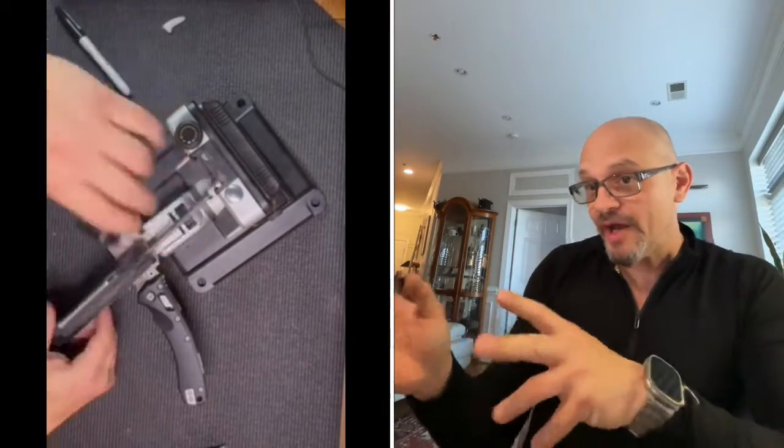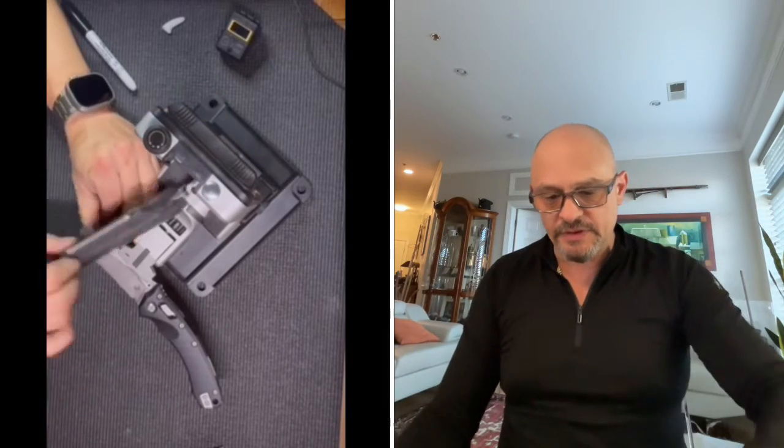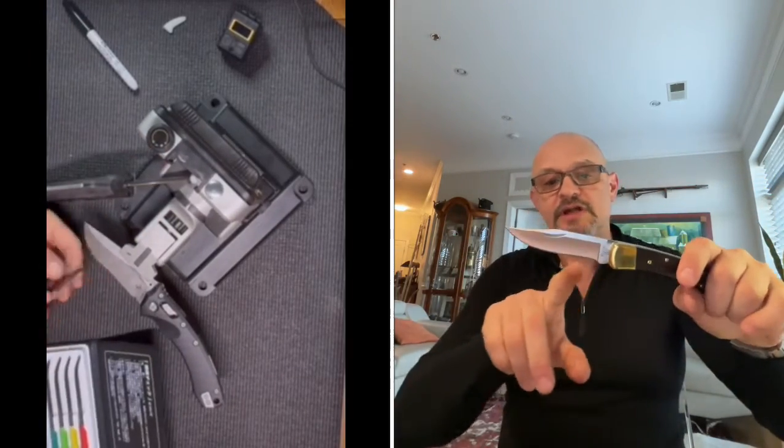While on my right you see me sharpening this knife, I will talk a little bit about the blade. The acceleration there is 8x, 8 times faster than I really did it. So, recurve, nothing new there. Look at this Buck 110, it's always been that way. It always had a recurve, and somehow your grandfather was able to sharpen it without too many complaints. Why am I saying it this way? Because there are a couple knife reviewers out on the webs that talk smack about recurve blades and how hard it is to sharpen. Maybe it's hard if you're using a stone this wide, but on a narrower stone, like with this Worksharp Precision Pro that you're seeing there on the screen, it's not much harder.